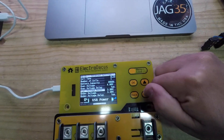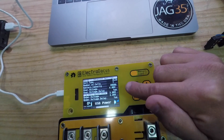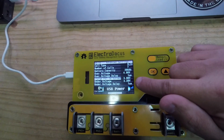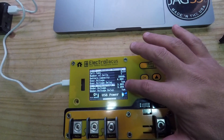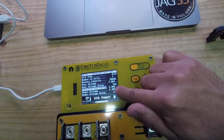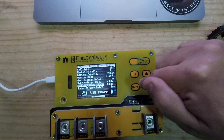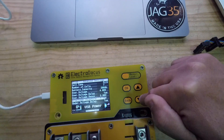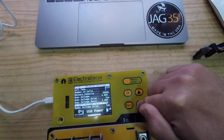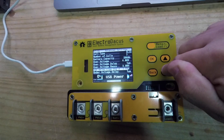You can also adjust the overvoltage delay and overvoltage recovery — once all cells fall below the threshold, the FET is turned on. So once all the batteries recover to 3.8 volts, the unit will start working again. For undervoltage, it's currently set to 3.2 volts. Lithium cobalt oxide can go all the way down to 2.5 volts, but a lot of the damage happens way down there, so you might want to do something like Tesla and leave it around 3 volts.